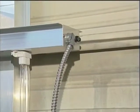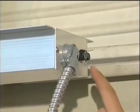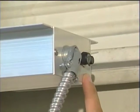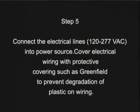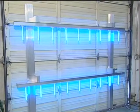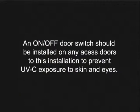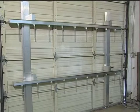You will notice that all connectors are equipped with a green field connector, which should be hooked up to green field or some other type of conduit and run to your electrical supply. Notice that on the end of the unit you have a fuse that will blow in case there are any shorts in the unit, and you have your on/off switch. All you have to do is push it in and your units come on, push it and the units go off. Anytime someone's working inside an air handler, flip it off — but you should also have a switch outside the air handler, or a door switch on the door of the air handler, so that when you go in and out the power to the unit is shut off, preventing anyone from getting burned in their eyes or their skin from the ultraviolet emitters.